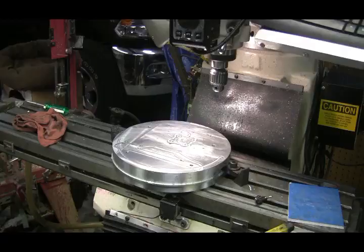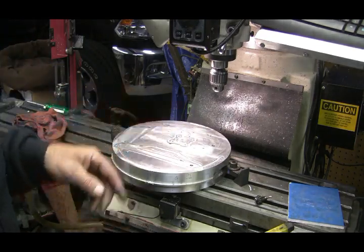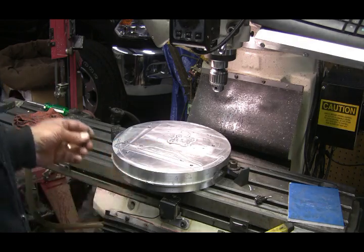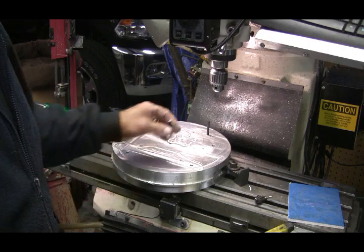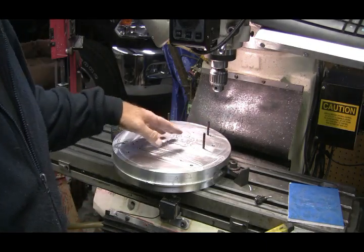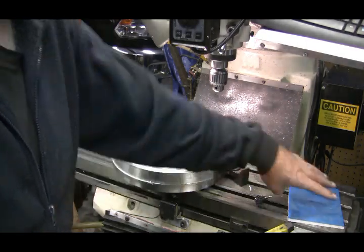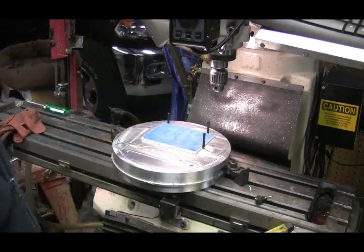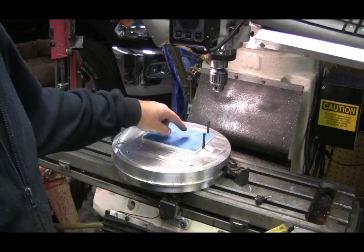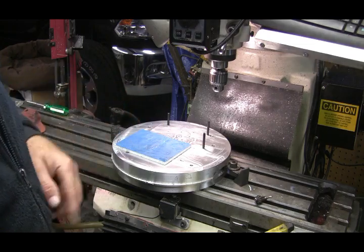Here I am over on the CNC mill. I use this for a lot of different parts and little trinkets that I make. What I did was put in dowel holes here, just building a little fixture — basically a holding plate. I put three dowels in, so my program will be called off of the centerline. I'll take my raw stock and nest it in there. Before I do this, I'm going to poke some holes, drill and tap them in the plate, so I can put bolts in and bolt the part down.